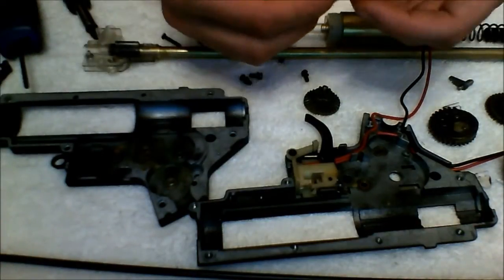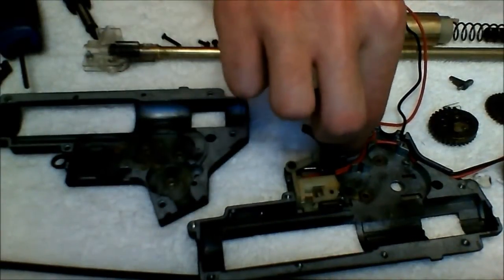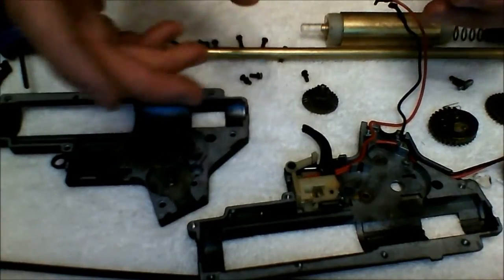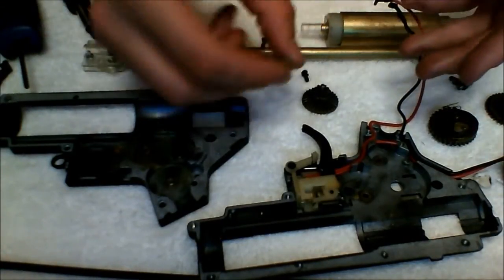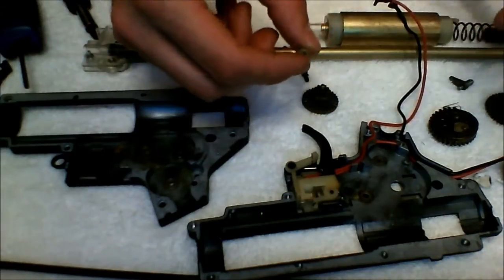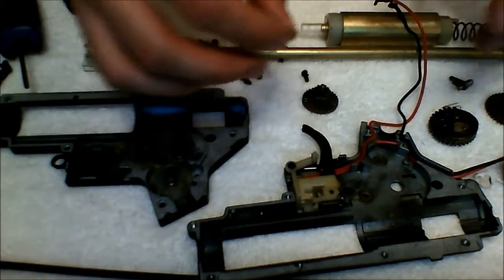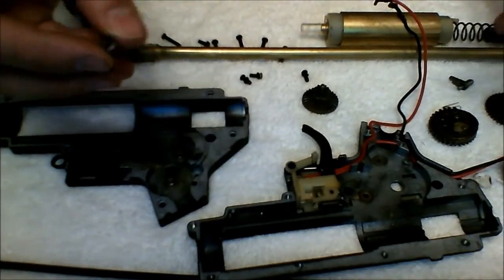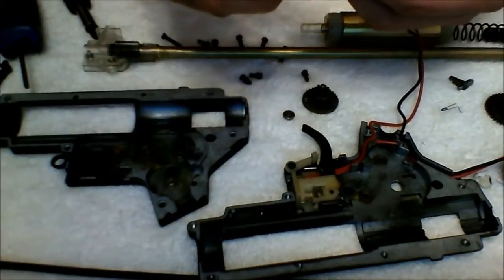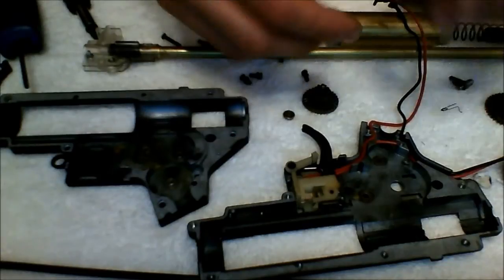It's solid, so you don't have the problem of failure as much, especially because bearings are fit to spin inside each other. So you're not going to have the problem that this could fail and this could just pop right out or be deformed, whereas a bushing would take much longer to deform, and that would only occur because of the revolutions. The gears themselves seem to be of pretty good quality.